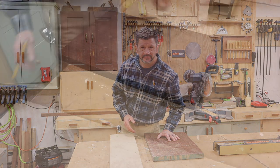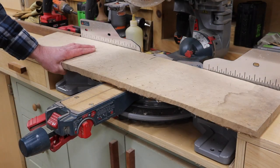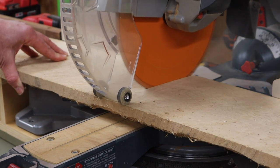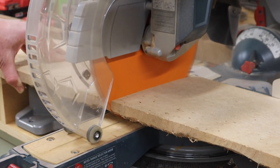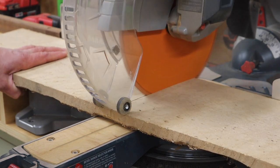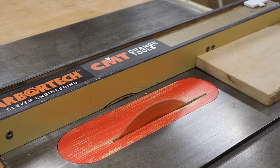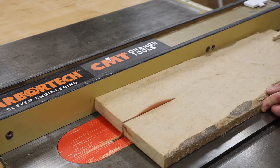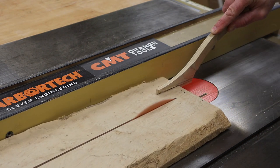I'm going to start by cutting this piece of maple to a rough length. You can see how warped this board is, and you have to be careful when you're cutting a board like this because the blade can bind and jump on you, like it did on me right here. It's also a little scary ripping a board like this, so I'm going to rip the board almost in half, trying to get the board as flat as possible, and then I'll readjust the fence and rip my parts at an inch and a quarter.